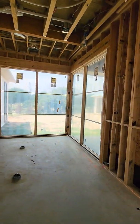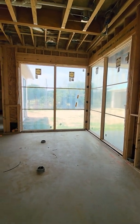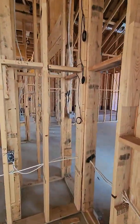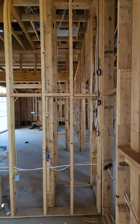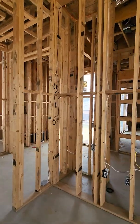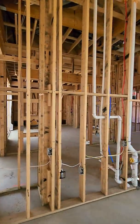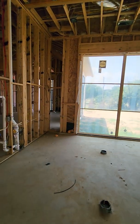Coming into our office, we didn't really have a good location for a TV in here so we just prepped it. We're going to have cabinet LEDs going in — we have floating shelves so all of our locations are marked off of our cabinet plans and we got our wiring come back. We do LEDs a little bit differently than a lot of electricians. We like to home-run all of our wires back to our AV closet and have a space dedicated just for our drivers for troubleshooting.